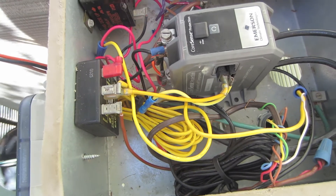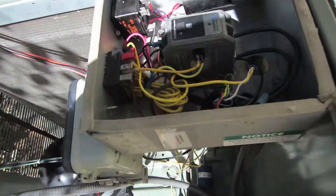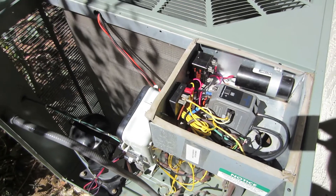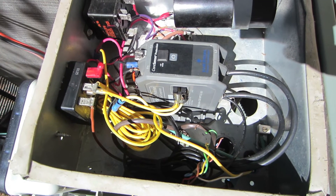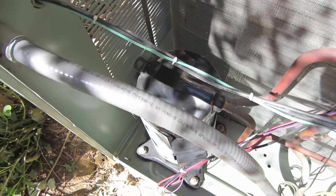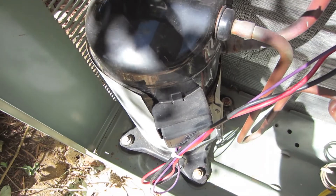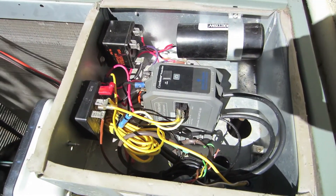Basically, this is monitoring the compressor — making sure everything with the compressor is running good — because you want to protect the compressor. Now the compressor for the first time ever has protection. I'm going to give it power and test it out. The unit is operational and the core sense protection went in without a hitch. A couple of modifications, but nothing that an experienced technician can't handle. The core sense protection is monitoring the compressor — the compressor being the core. If that compressor operates outside the operation envelope continuously, the algorithm in that core sense protection will pick up on these faults, issue a fault code, and that's where the technician has to come out and figure out what's wrong with the compressor. Pretty cool little product.